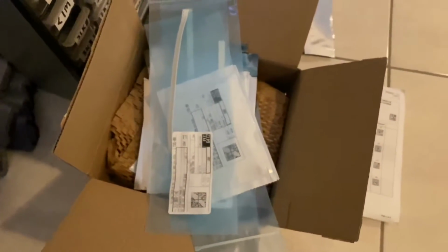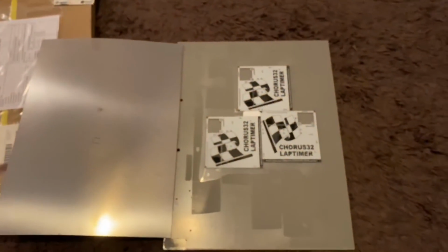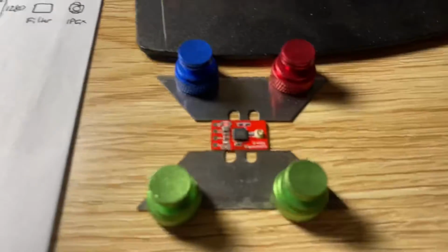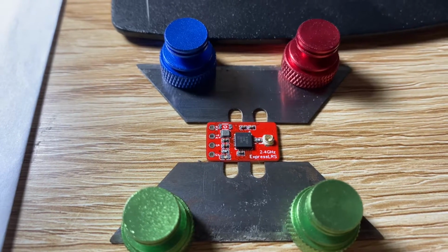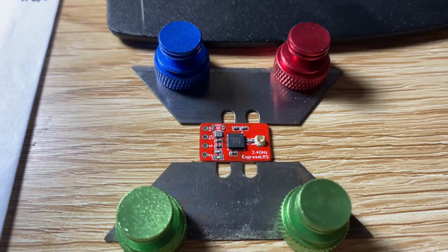So I went and ordered a bunch of parts from DigiKey, and now we've also done the stencil, which is over here on the floor because that's where you work. I don't know if you can see that, but there's a tiny little stencil there for the RX. So I've solder pasted one up and used my awesome cheat sheet here with where I put all my little parts. So we're now at the point where all the parts are on this PCB. It's been solder pasted, it hasn't been reflowed yet. So let's chuck it in the oven and see how we go.